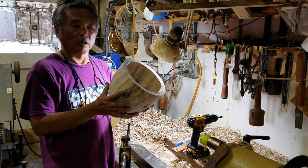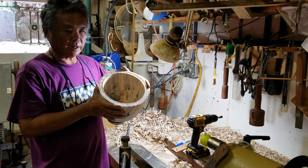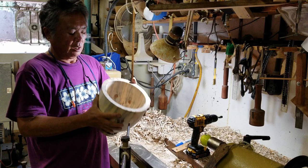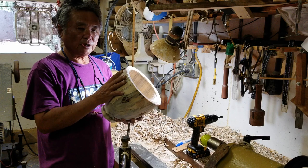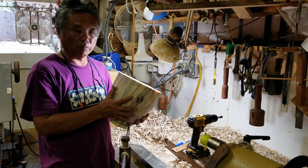The reason behind this is that as the wood dries the roundness of the bowl will change — it will warp a little bit. By doing it the second time around you eliminate the warpage and you end up with a round bowl. I like to do it with Norfolk Island Pine and Cook Island Pine because you need to go a little thinner than most bowls in trying to bring out the translucent colors of the wood. That is why I do all my end grain bowls double turn. So now I will coat it and put it back on the shelf.